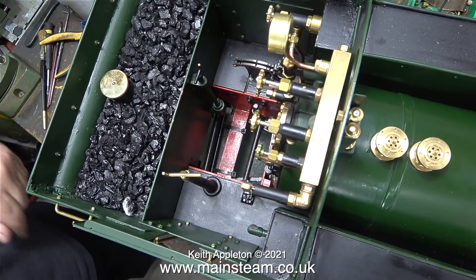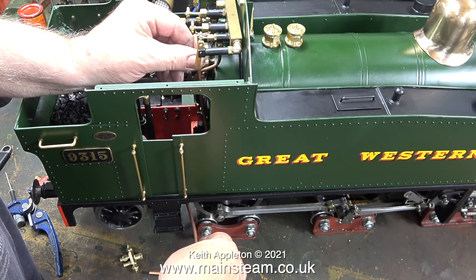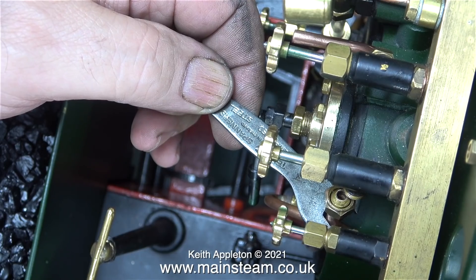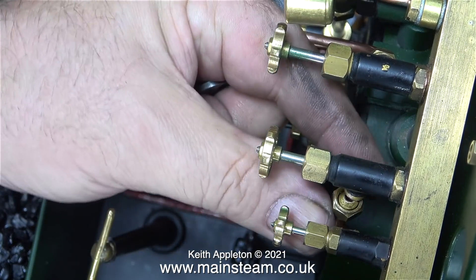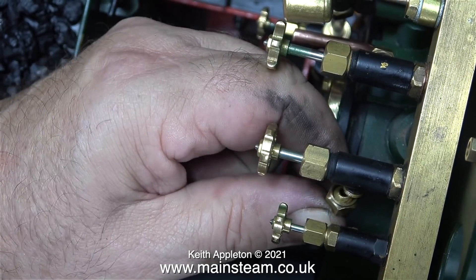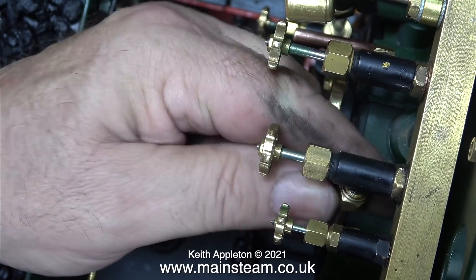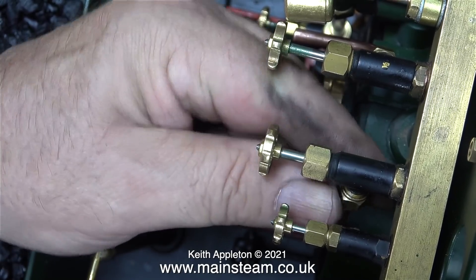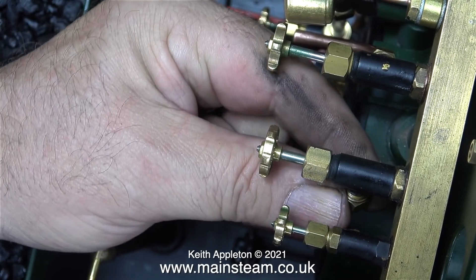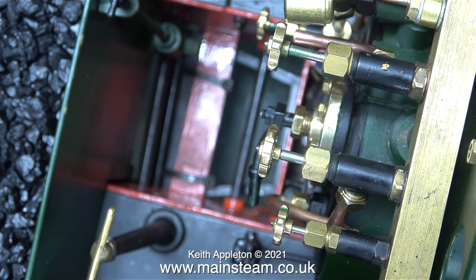Piping the injector — these are not difficult jobs but very time consuming. There's a lot of repetition and you have to be really careful not to scratch the paintwork as you repeatedly make test fits of the pipe. Finally I got the pipe to exactly the shape I wanted, then I silver soldered the union cones on each end, bearing in mind that the one that fits on the injector is a flat one. You really have to be careful because if you cross-thread these nuts the tap has to come off and you start the job again.